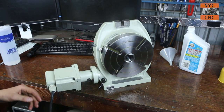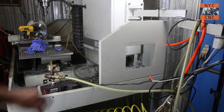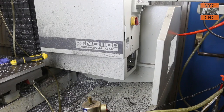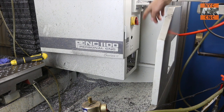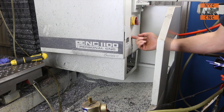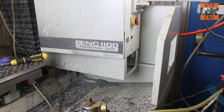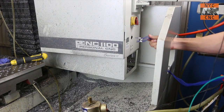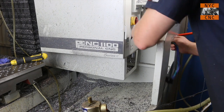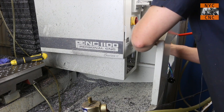Okay, let's head over and deal with the electronics. Next up, go ahead and remove this panel — four quick screws — so we can get to the inside where we really need to work. We'll remove this little guy. Before we feed the wires in, kill power to the machine. Make sure you at least turn this knob off and preferably unplug it from the wall. My connector did not fit in here, so I had to take a deburring tool and just knock off some of the residual paint — no big deal. Now we will take our four blue wires, stuff them through to start, and then catch the green ground as well.